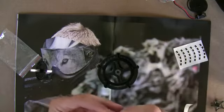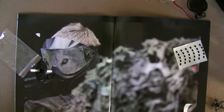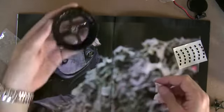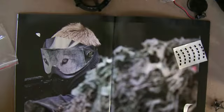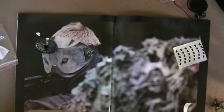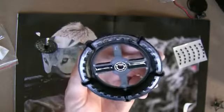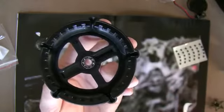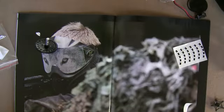So we'll do that. I'm going to take my alcohol pad and just give the surfaces on the bottom of the encoder and the carrier a little bit of a wipe. Set that to the side so it can dry. A little bit on the same with my drive gear. Now you don't actually have to put the encoder stickers on. You can leave them off and the LTD will work as it is as standard. But some of the very advanced functionality that's coming from Paintball will require the encoders to be functional. And when you do the test that checks all the functionality of the loader, it will test to make sure that the encoders and everything are set up properly. Get the alcohol just to dry off.